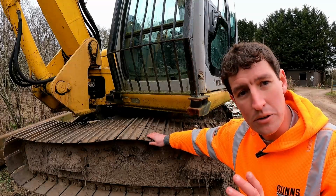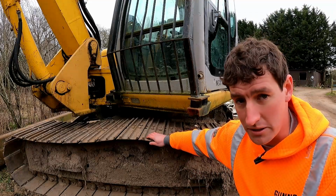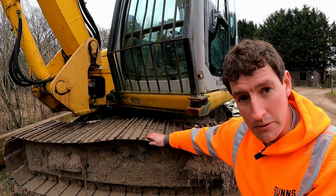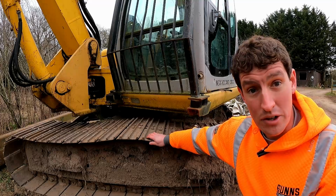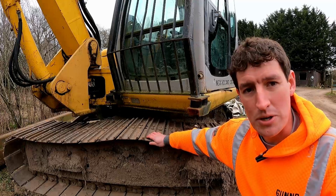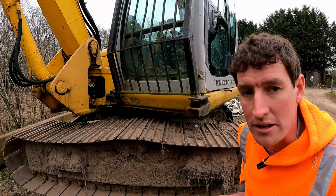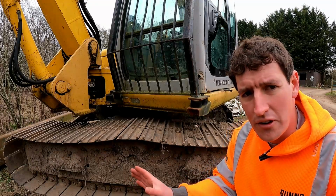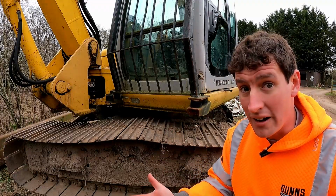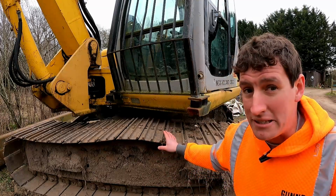And your pads may well outlast 2 sets of chains, depending on the sort of work you do. So steel tracks are a little bit different in that you can change the components of the track in order to save cost and outlive other parts of the machine, whereas with rubber tracks you pretty much have to buy the whole rubber band because it's all made as one, right? So if you find a machine with worn tracks, it may not necessarily mean you've got to replace the entire track, right? But generally it'd only be pads you'd save.